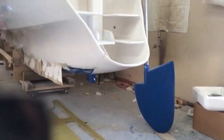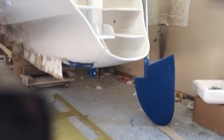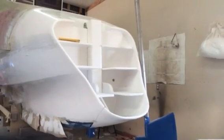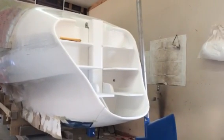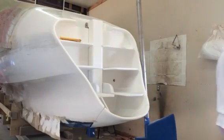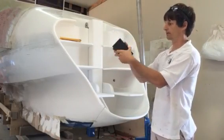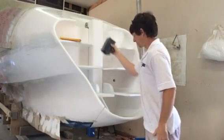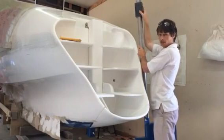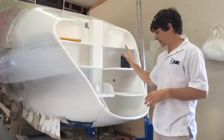I'm going to show the kick-up rudder system — this is one of my favorite parts of the boat. You can see the rudder there; it's going to go in that center box. This rudder box has two rudder bearings in it — very dense plastic. This piece was done incorrectly and had to be redone, so it's just a spare. There's one up here inside and one at the bottom. These fit exactly over this stainless steel piece and they're saltwater lubricated.